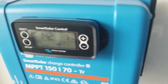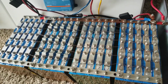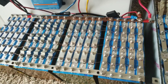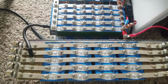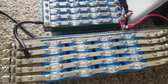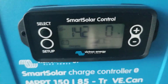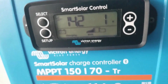And I decided to wire them all together because I don't want to create any long series strings, because I'm sitting on the deck, which is covered with a lot of shade. So if one panel is shaded, if they're all in parallel, they still work. It doesn't matter. It's just one panel is down, and you can still have the amps. You have more amps coming in, so if other panels are covered, you're still fine. So this one is the one with the 50 watts, and the 83 is a mixed match panel. All in all it is about 700 plus watts in this.